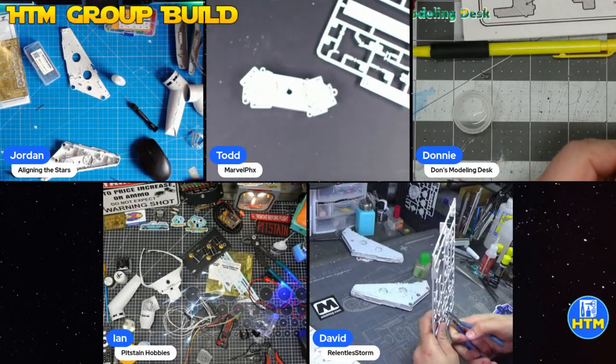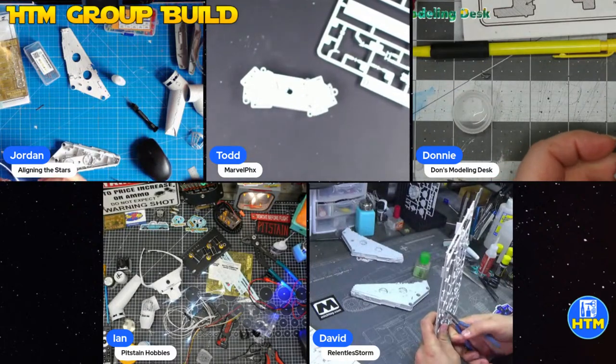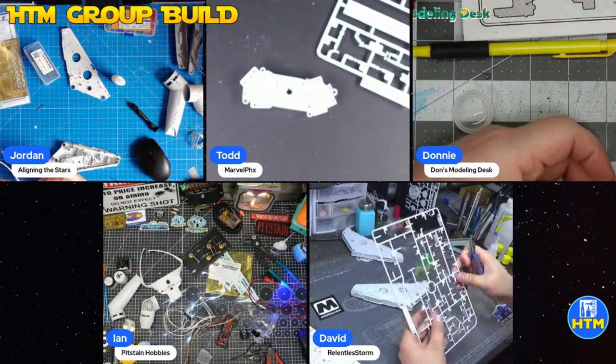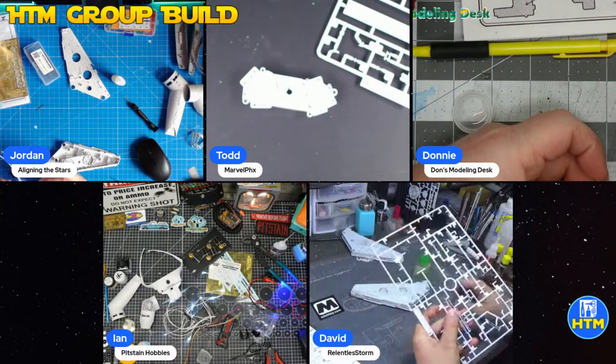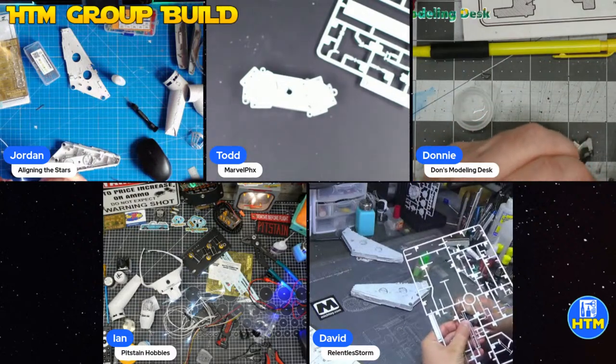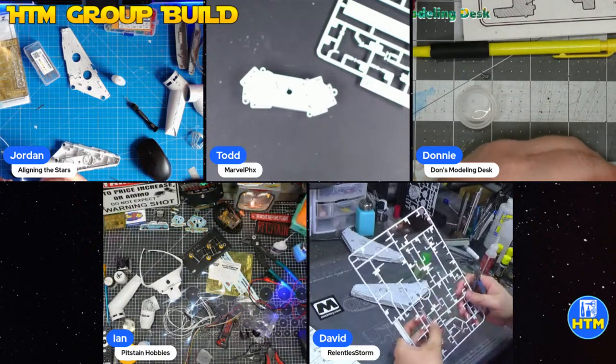So the trick is I've got to watch the voltage I put on there. The voltage, yes. The voltage is very critical. LEDs are very sensitive to being overvoltaged. Even if you don't burn it out, you will, as Todd told me, shorten its lifespan by an unknown but possibly massive amount.